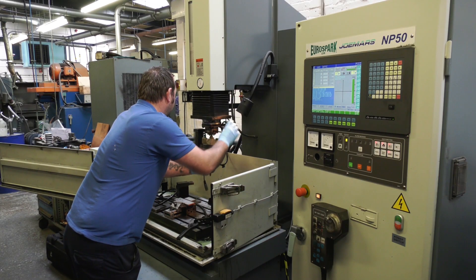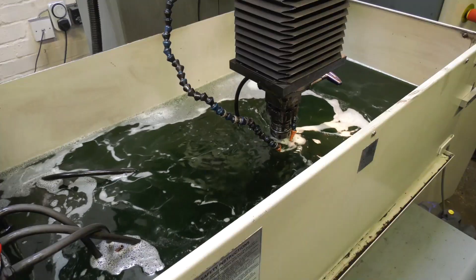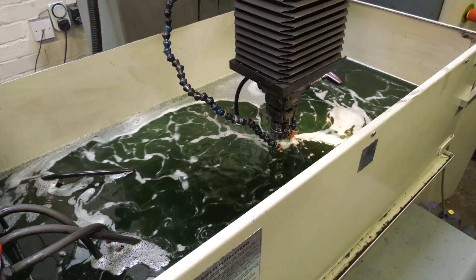How would you class their reliability in what you're actually doing here? It's very good reliability — obviously repeatability of parts and stuff like that as well. How important is that? What are the tolerances, what are the accuracies you're cutting to on really hard materials? On hard materials it's usually about 20 micron limit, so you're talking just under the thou of an inch.